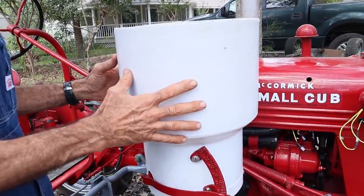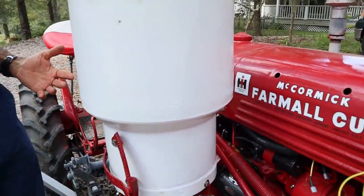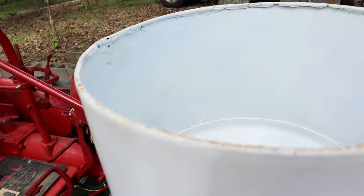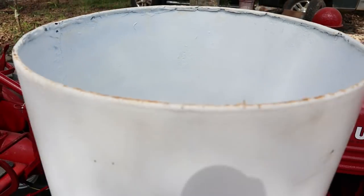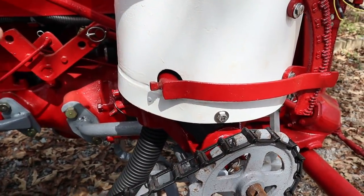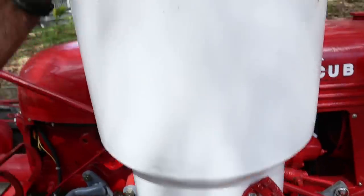When I got the tractor, this came with it. If y'all remember the original videos, this was an old galvanized one - it had rust holes in it, big ones I could put my hand through the sides of it. But after looking at the price of a new one, I told myself I'd be better off just trying to rebuild it. So I took some sheet metal, replaced some pieces, put JB weld over the outside, ground it all off smooth, replaced the ring around the bottom with a new galvanized steel ring, and went back with all stainless steel bolts in everything inside this fertilizer distributor.